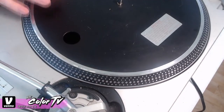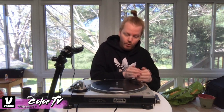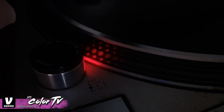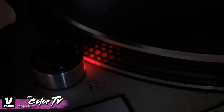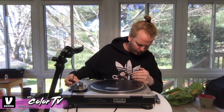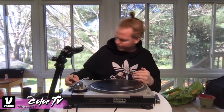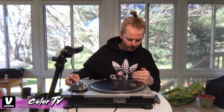I'm going to cup this and test it in a darker area. At zero, the dot seems to be staying in place pretty well. Now let's go up to the second dot — I'll move the pitch fader until the dot just above the big dot stops jogging. That's stopping at about 3.8, so we need to adjust.